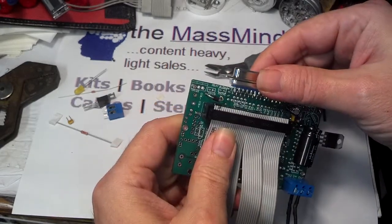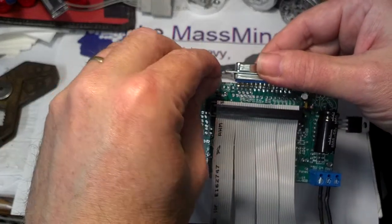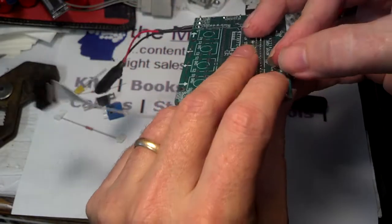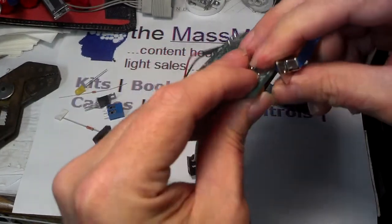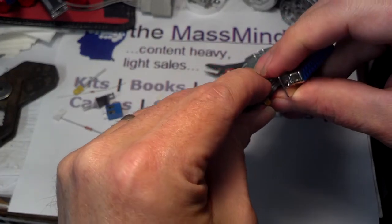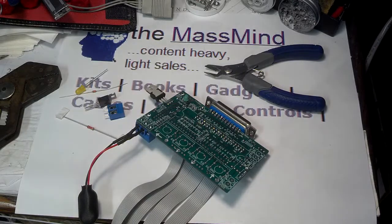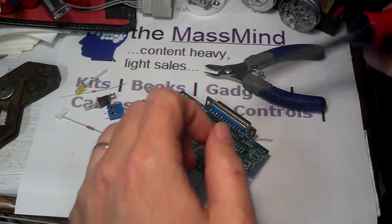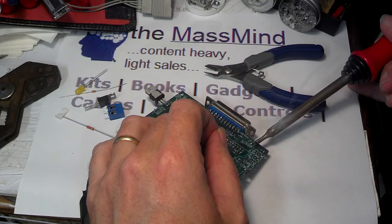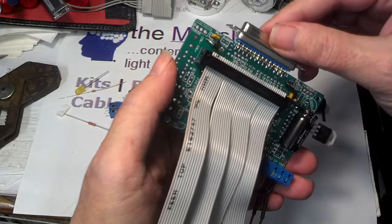That component's in place. I'm going to bend it out of the way ever so slightly. We have a nice little capacitor here — C10 — that drops in right here. This is just a little ceramic disc capacitor, so the orientation doesn't matter. It is a bit difficult to get any lead length on that because there's hardly any lead to speak of. I'll go ahead and solder that on. I was probably on that a little bit longer than I should have been, but it's just a capacitor, so hopefully it'll be okay.